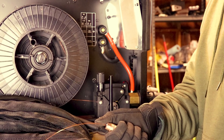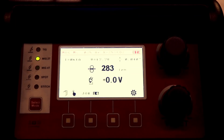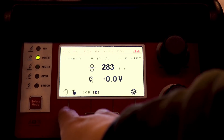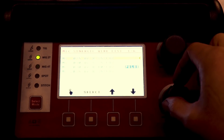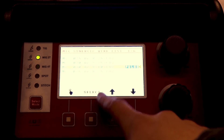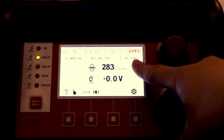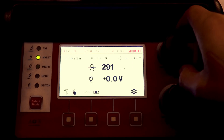With this I'm just running regular 0-30 ER70S6 wire. To get into pulse mode on the HTP you just go into mode, scroll to pulse steel, make sure we're using 0-30 wire and we're set up with either a 90-10 or 92-8 gas mix, hit select and boom — ready to weld on some pulse.